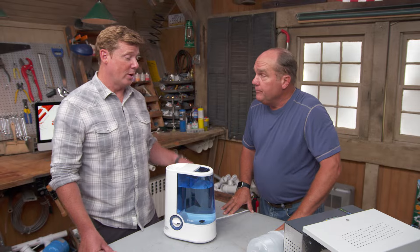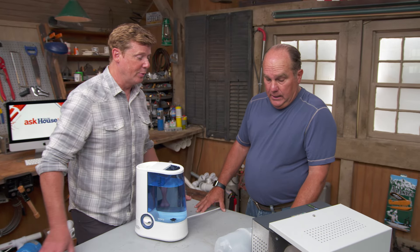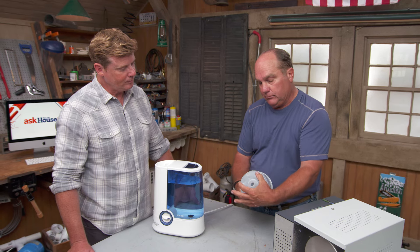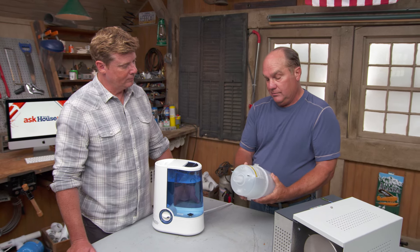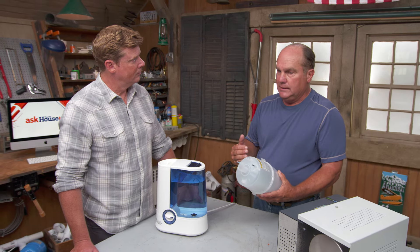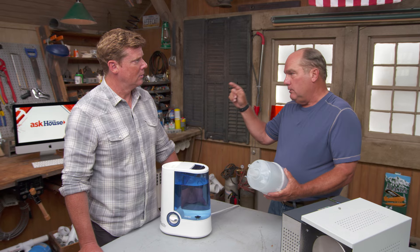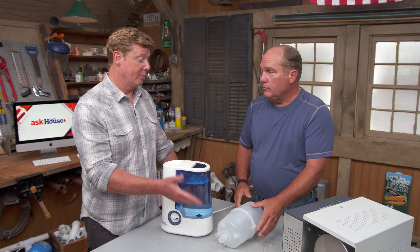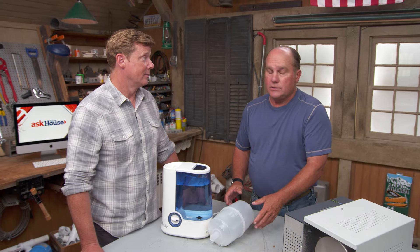It is super dry out there, so what's the maintenance on the device installed? This canister has two electrical connections, water in, and a drain out the bottom. Depending on water quality — if you've got high calcium or high minerals — it could probably clog up in a year, or it could go a little more, maybe every one to three years. To replace it costs about a hundred dollars. At least there's a call-out light on the unit that'll tell you when it has to be replaced — though a hundred bucks potentially per year plus operational costs is something to consider.